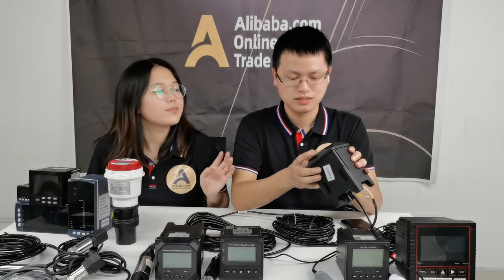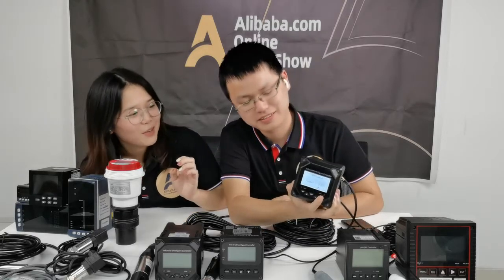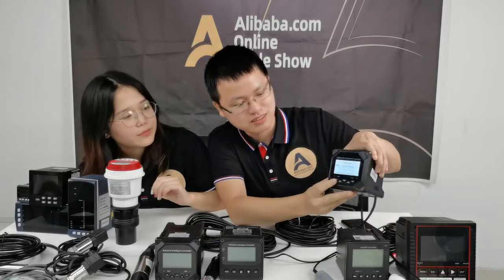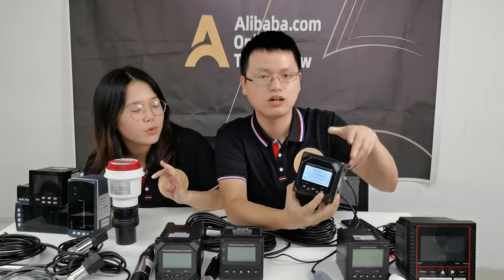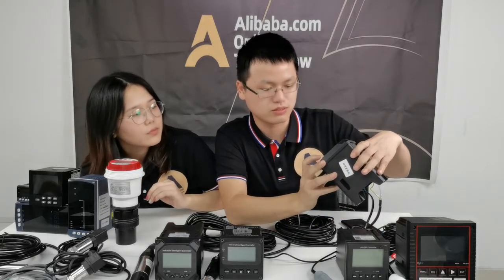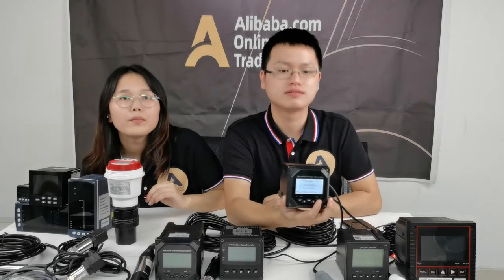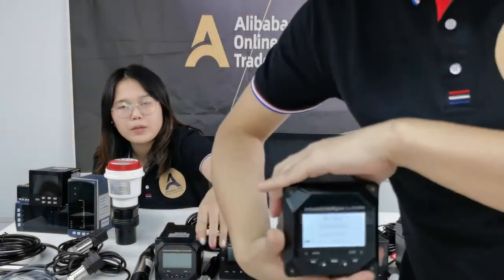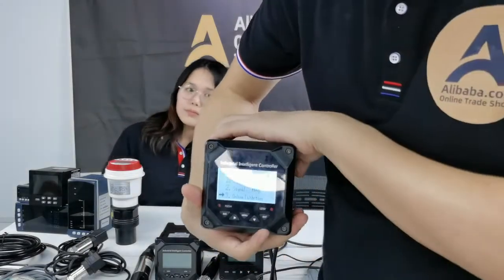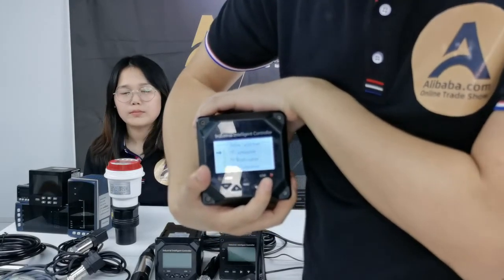Now the language is English. Press menu, and on the menu you have to input the password — the password is zero. Just press enter. Then, on the setting, you can choose the calibration — that is the third one, online calibration. Jerry will walk over and teach you how to use this pH controller. Select online calibration, then select the pH count calibration.